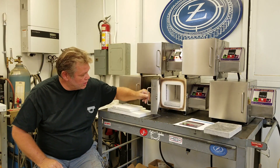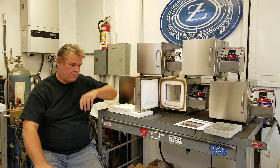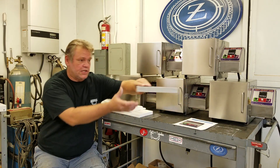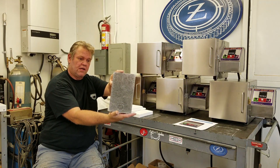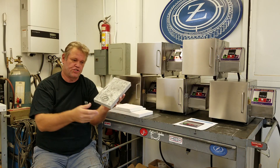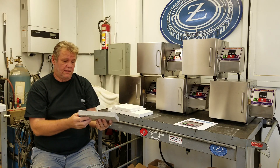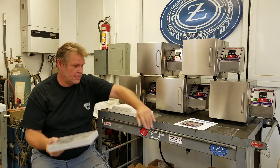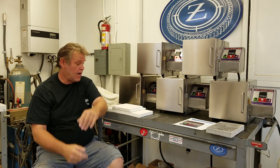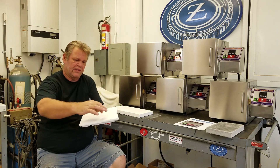You'll notice this oven's floor is chalk white — that means it's fully cured. This other one has been out in the sun for 72 hours but you can see how dark it is — there's still a ton of moisture in there. If you heat it up too quick it'll just shatter. Curing each individual brick without a larger oven is really time consuming, so I was talking to people at a place called Foundry Refractory Supply about this.